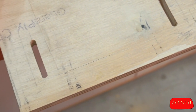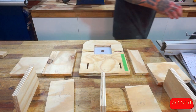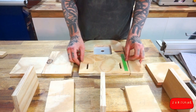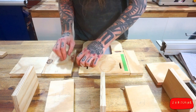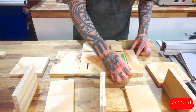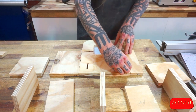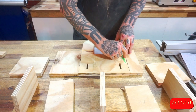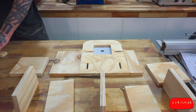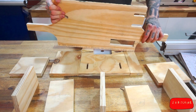Now we have all our pieces made, it's time to put them all together. These are the jig parts upside down. If you have a pin nailer, this is the easiest way to assemble the jig. If not, lay your pieces out like this first, so you can identify where you want to pre-drill your holes for screws. This is the prototype for a jig kit I'll be selling very soon for under 30 US dollars. The finished kits will be MDF and made on the CNC, so look out for a future video where I go through all the assembly again in a lot more detail. The kits will be pre-drilled or normal, depending on if you have an air nailer or not.